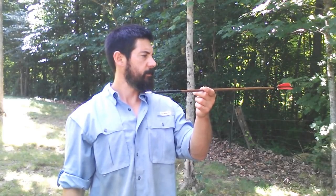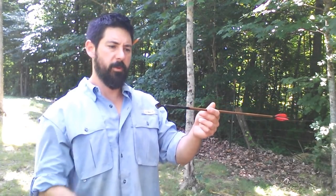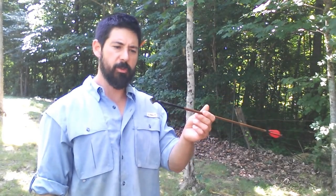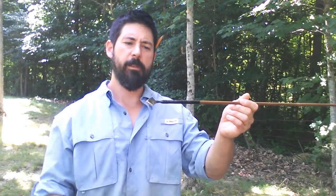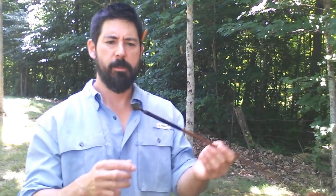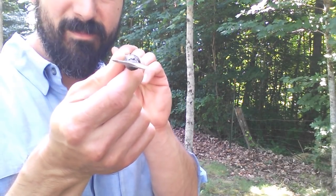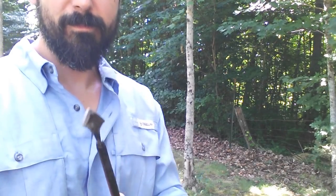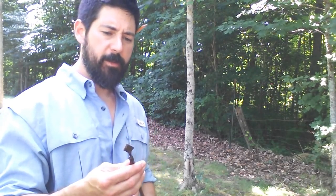So here's the arrow we'll be using today. It is a bamboo arrow, crudely made, primitive steel point. This is a design that I use and feel very comfortable with. This is just hammered out cold, no heat — it's just work hardened and shaped on the grinder to the desired profile that I like to use. And it's a single bevel, just sharpened right off the grinder.